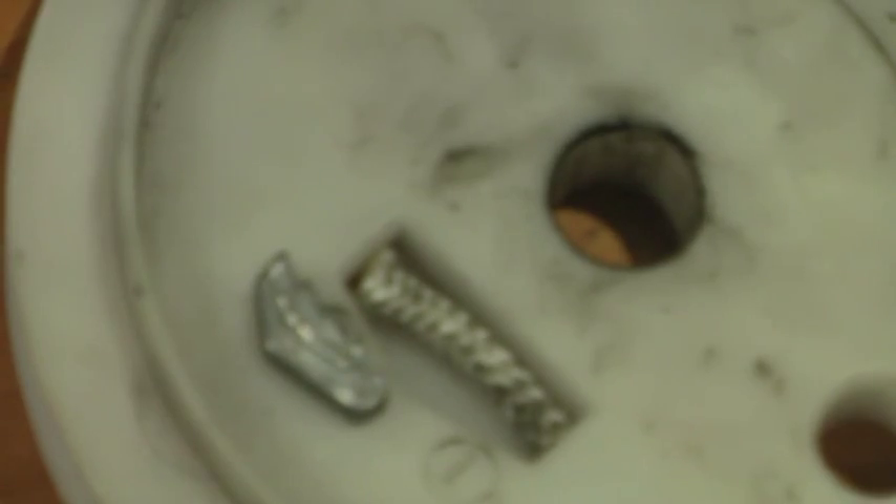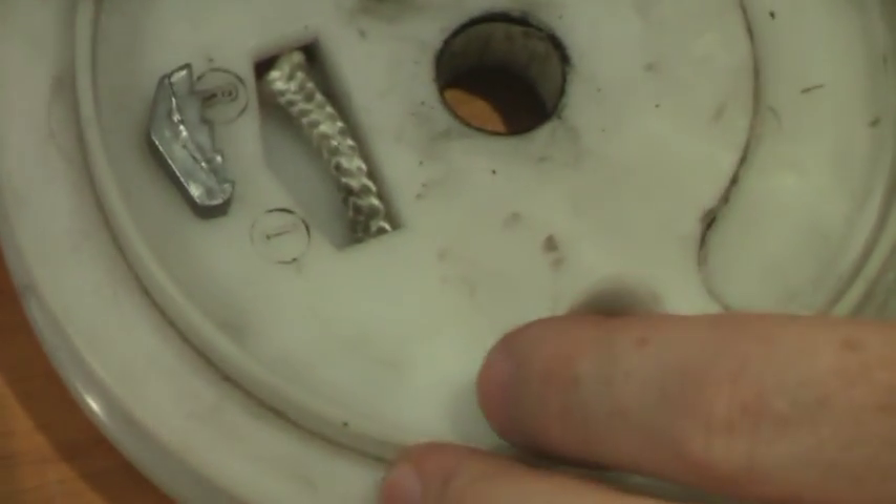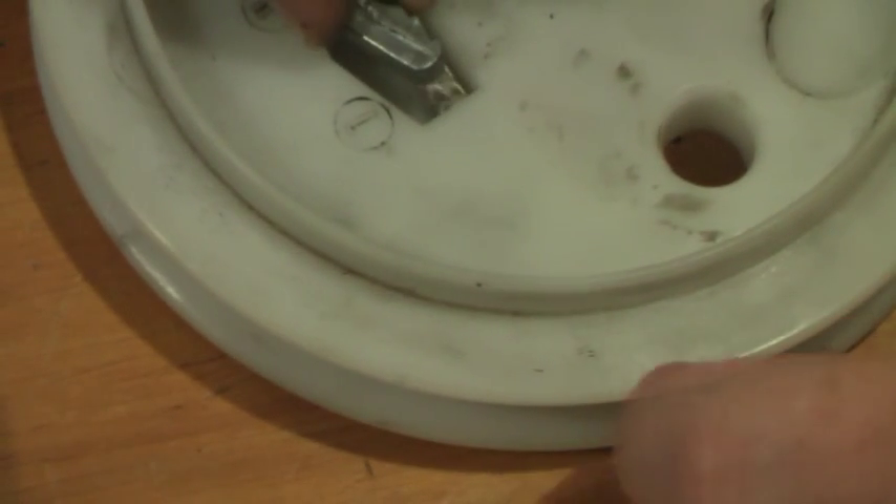The rope end is there — it doesn't go any further, but it's kept in there by this wedge into the hole. If you look on the other side, by just knocking that out with a tool you should be able to dislodge that wedge mechanism. There it is — you can see the whole wedge piece lifting up. That's the mechanism that bites into the rope and holds it. It goes in there, pulls against the rope and bites.